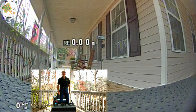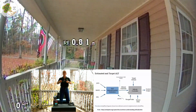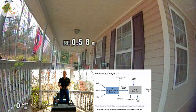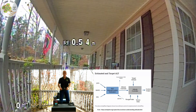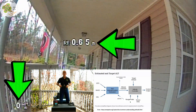Another way to see if your LiDAR is working is to check the measured distance in your OSD — again with it powered on, simply move the quadcopter vertically up and down. You can see the LiDAR rangefinder's measured altitude near the middle of the screen and the estimated altitude from the extended Kalman filter (EKF) subsystem in the lower left. The EKF estimate is based on GPS and barometer, while the LiDAR provides altitude measurements when within the rangefinder's operating range, modifying the altitude control output. Notice the LiDAR's measured altitude is of higher fidelity — shown to the second decimal point — than the EKF estimate.